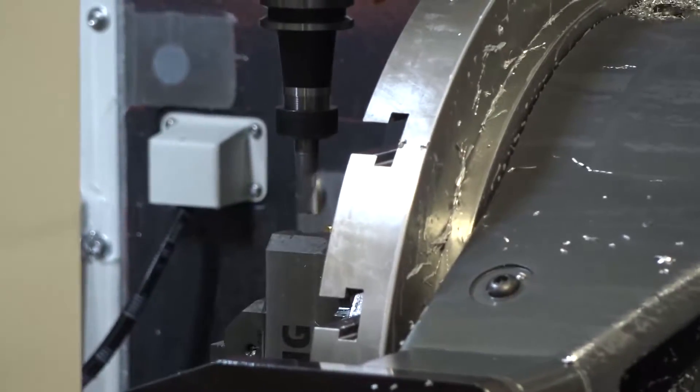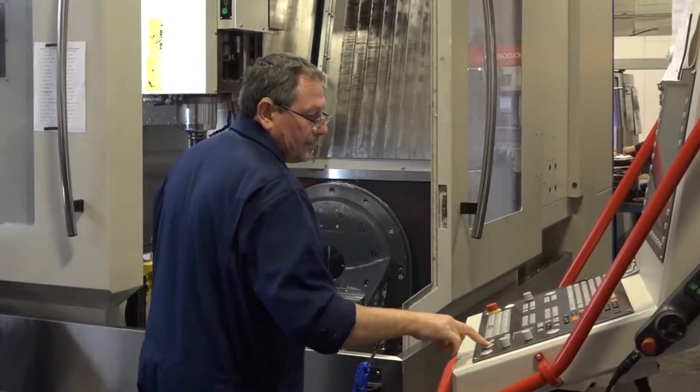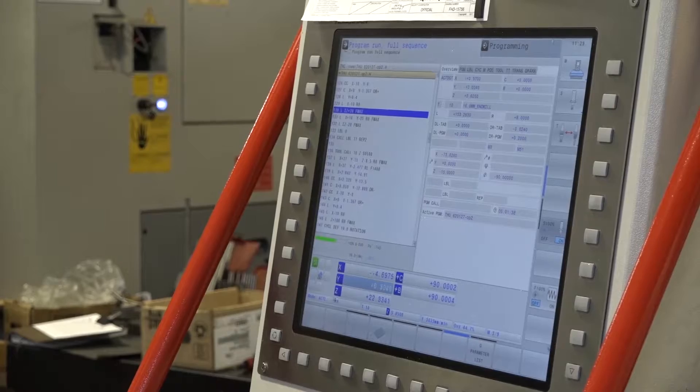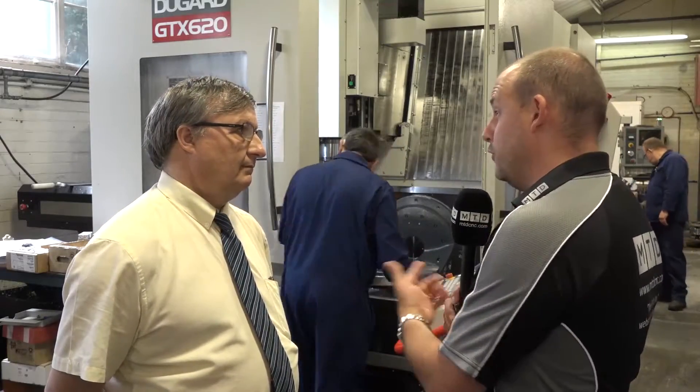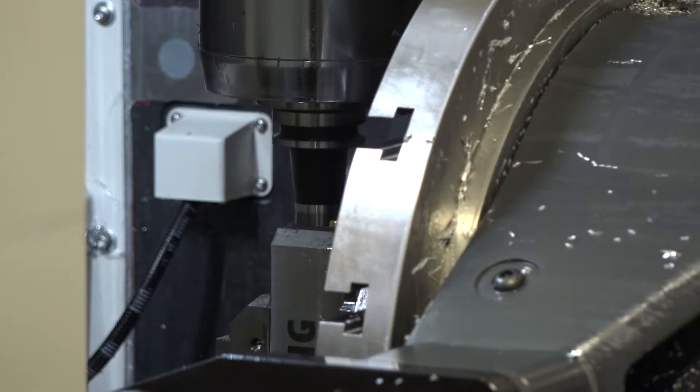The machine is a very heavy-duty five-axis machine. It's got heavy-duty roller guides throughout, built on a supremely heavy cast base. You've also got the Heidenhain control here that you selected. What I find interesting about your business is you're doing all your programming here at the machine. Yes, most of what we do is small volume and the guys on the shop floor actually find it really easy and simple to program. It's not always easy in CAD but we find the control a lot more user-friendly. If we get a really complicated job we'll run that through CAD, but the majority of what we do is simple enough to do straight on the machine.